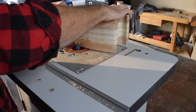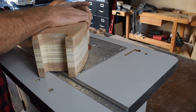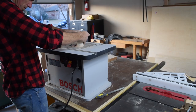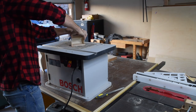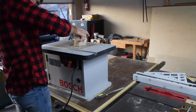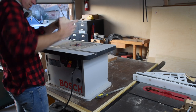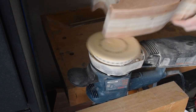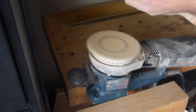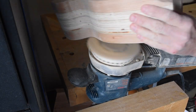I used an eighth-inch round-over bit to put a round-over on all the edges and also on the inside of the drawer voids, and once this was done I could put a round-over on the actual drawers themselves. This is a potentially dangerous process, so make sure you know what you're doing and always push the piece against the rotation of the blade. The best way I found to finish sanding and shaping was to clamp my orbital sander into my vise and shape the round-over that way — this gave me more control over the workpiece.